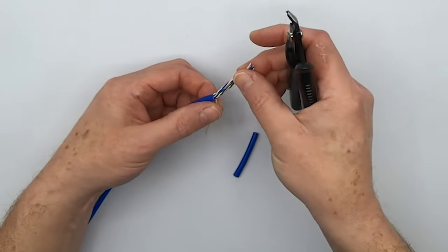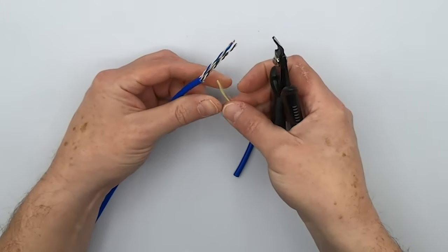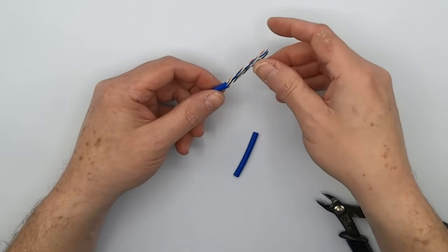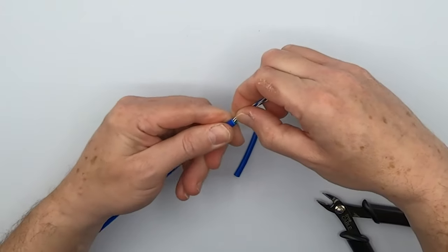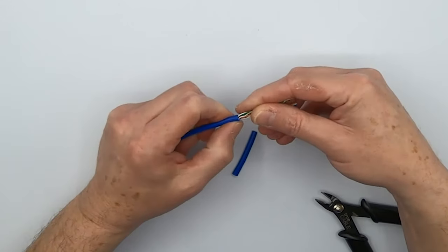The next step is to take off this ripcord because we don't need it — flush cut it right at the cable jacket. And then before you start working with the jack, it's important to check those conductors here at the cable jacket edge to make certain you didn't accidentally nick one. You'll be able to tell — you'll see a little cut there, maybe some copper glinting, and that's no good.